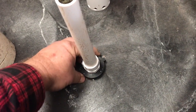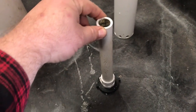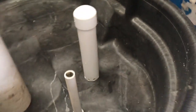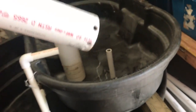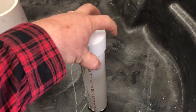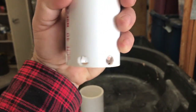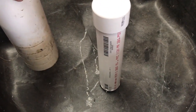This is the actual mechanism by which a bell siphon works. I've got a three-quarter-inch bulkhead — I'd normally do one inch in these, but I had three-quarter equipment on hand. A larger system I'd want one-inch for reliability on the bell siphon. This standpipe sets the height of the water. What happens is: water fills up, reaches the overflow point, starts overflowing, and as it does it creates a negative-pressure vacuum inside the bell. Water gets pulled up and flows down — pulls up, pulls up — until it gets to the bottom, hits one of those holes, a little bit of air gets in, and breaks the siphon. Then the water starts filling up again. That's the full functionality — no moving parts, nothing moves up and down.